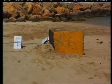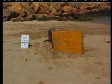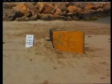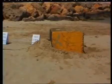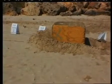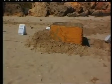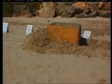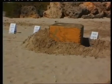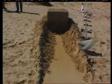The 1-ton clump weight had reached a holding power of 850 kilograms after dragging for 1 metre, and this continues to increase to 1,155 kilos at 2 metres, then reaches its maximum of 1,310 kilograms after 3 metres. The holding power hovered between 1,200 and 1,285 kilograms until the test was stopped after 4 metres of drag. The soil disturbance is again significant, with no penetration.